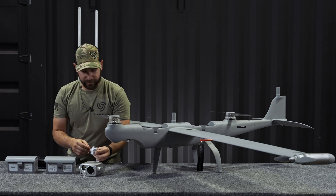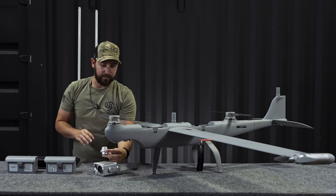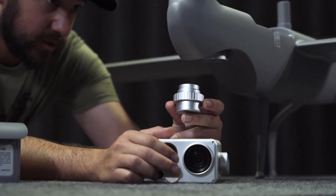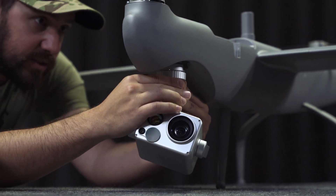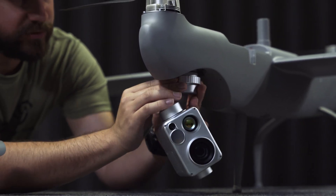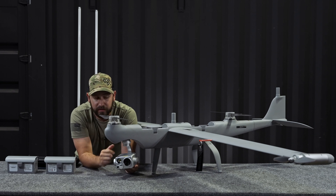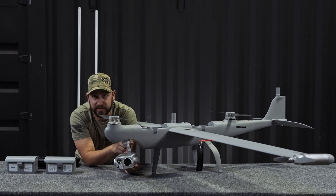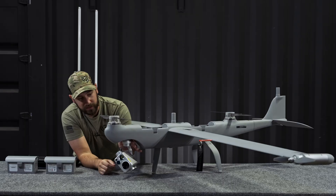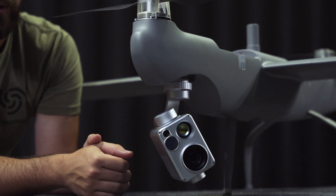Now I'm going to pop my payload on. The black button I want facing towards me. Much like many of the payloads we work with, there are two small holes and one large hole — I'm going to line up those large holes so I know I'm in line. Red dot to red dot. Get the payload on and then twist to lock. When I twisted that to lock it, I heard a click and I can see and feel that the black button is now back to its resting position, meaning it is locked in fully. I'll do a nice gentle rotation on the top of that payload to make sure it is secured to the aircraft.